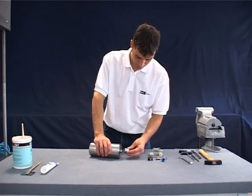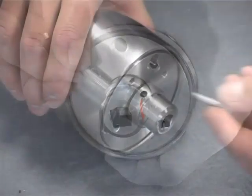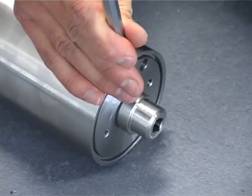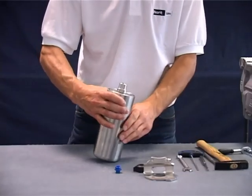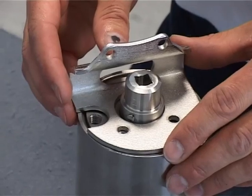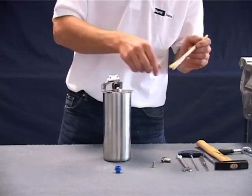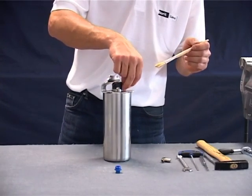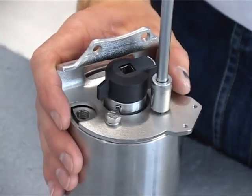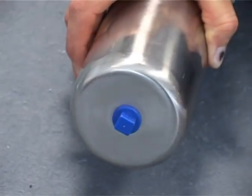Position the coupling making sure that the flat surface of the coupling is correctly aligned to the tapped hole of the air connection. The coupling is fastened with the taper pin, punch and hammer. Position the bracket making note of the air hole location, then position the target onto the drive. Apply thread lubricant to the two hexagonal screws and fasten the bracket with screws and corresponding lock washers. Finally the air connection and thread plug can be tightened in place.